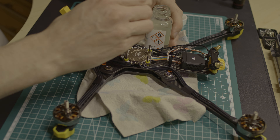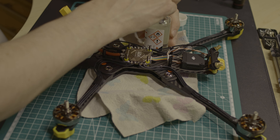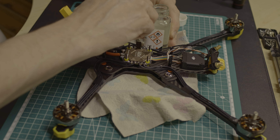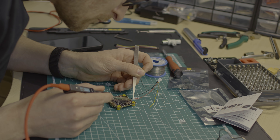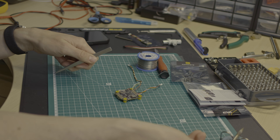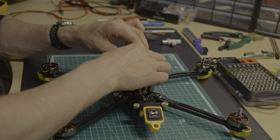After soldering, I decided to coat the ESC. I'm not sure if I'll make the drone completely waterproof, but I'll definitely cover the essential parts — this will give me more confidence when flying through clouds or starting in the snow. Next is the flight controller. I copied the idea from the iFlight builds to add connectors for the receiver and GPS module, making it easy to change these components if needed. I also soldered a connector for the beeper so it would be easily changeable. After completing the soldering, I simply connected the components by plugging them in.